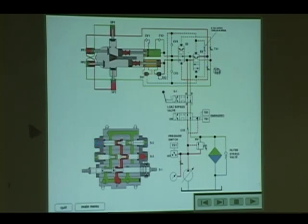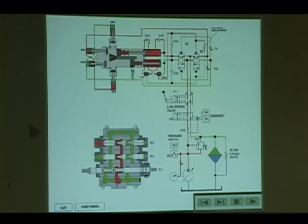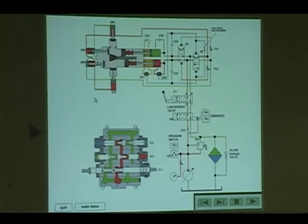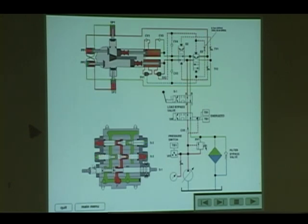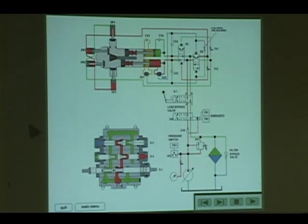As you're seeing the spool shift back and forth, you correlate it with your poppets and how the pump is shifting back and forth. The S2 spool actually shifts your main diff cylinders, and your S3 spool is shifting your poppet cylinders. They work side by side in unison with each other. And then you can see how the internals of the brain are working, shooting the pressure out to the pump.